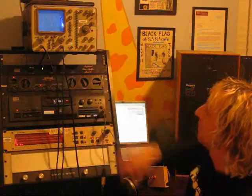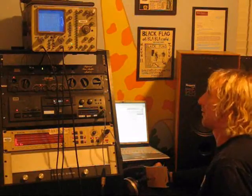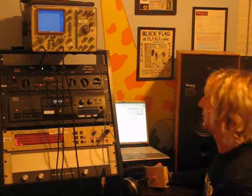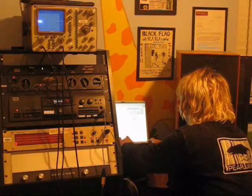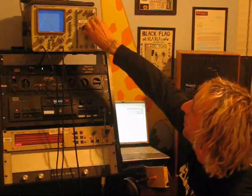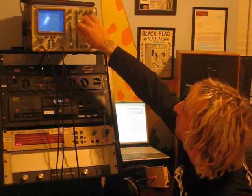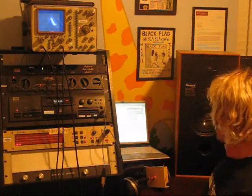At 20 hertz, we see a relatively clean sine wave, and not hearing any serious artifacts. In fact, check this out. We'll go down to 15 cycles. And at 15 cycles, we are about 1, 2, 3 divisions. We're about 6 dB down, half the voltage at 15 cycles. It is beginning to triangle wave a bit, but that is a full step above anything else I've tested.